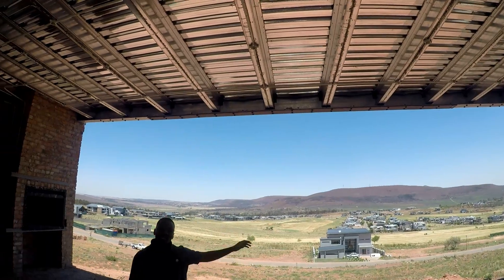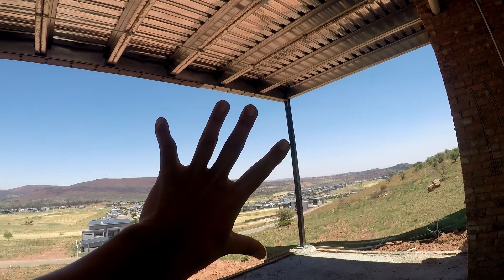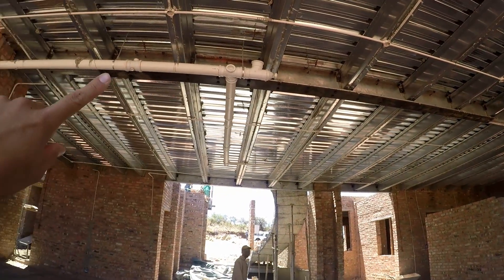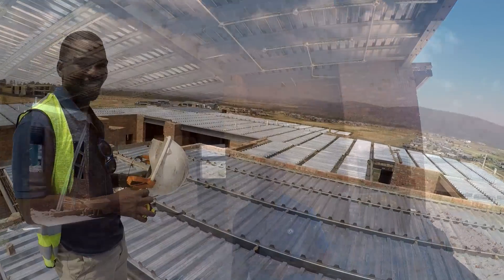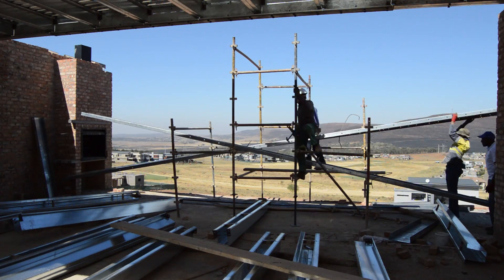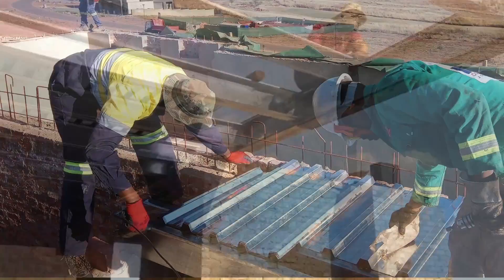That is one of our ten and a half meter long fluted floor ultra longs. Ten and a half meters! Look what it's done — by using our ten meter ultra long, look what it's done for the view. And then also on this side, another ten meter span. There's something quite special about how this whole system is installed. Built into the development of the fluted floor system and its accompanying components is simplicity. In this project, no crane whatsoever was used — the ultra longs, the main beams, and the system were put together by three men using drills and a grinder.